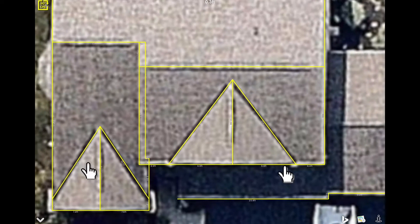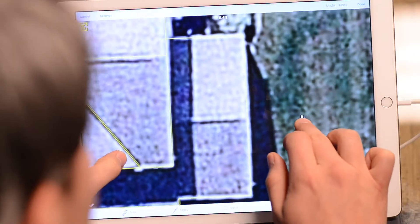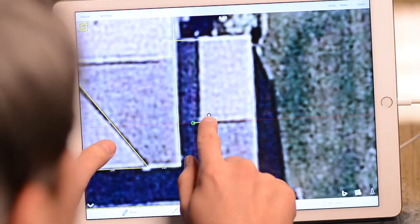Now we're going to pause on that area and come over here to draw in the lines as well. We've got the rake that comes down here and it's going to turn and make an eave. I don't want to stop right here at 10-4; I want to go one foot past to 11-4. Then we go back to draw mode and bring the ridge over. 90-mode will plot it perfectly straight, so I don't have to worry about going one foot past once I already have a line that represents a foot past.